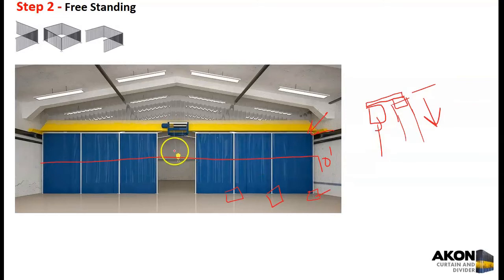There are a lot of different scenarios. If you want a complete seal from above, we can use strip curtains — the clear strips we sell for door openings — which mount to the roof deck, beams, or purlins. The crane will just push through these, pushing them to the side and they flop back, just like when you walk through them with a push cart or forklift. Freestanding gives you a very clean setup with no sagging like you might find in a cable system.